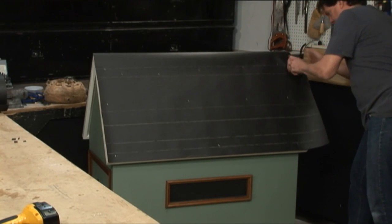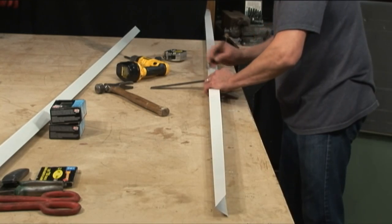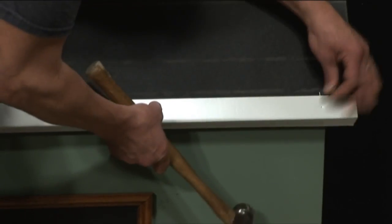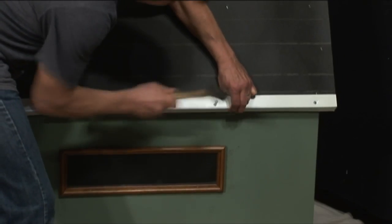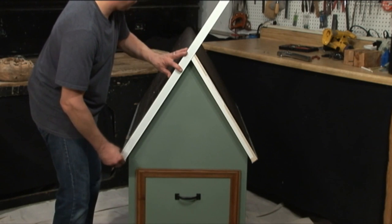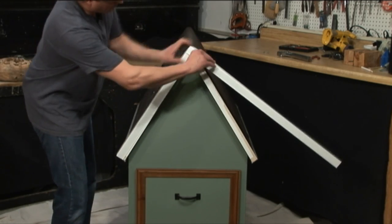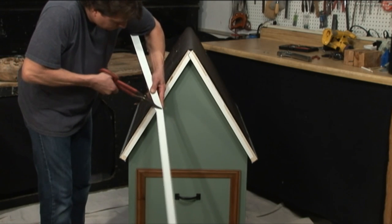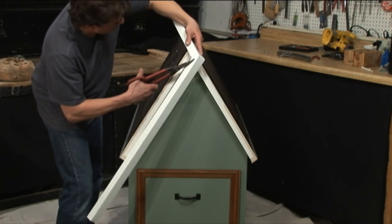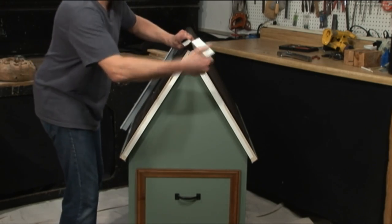Trim your tar paper using the side of the roof as your guide. When we measure for our drip edge, we come up with 45½ inches — make a mark on the drip edge and give it a nice square cut. If the cut doesn't go all the way through, wiggle it back and forth and it'll break. Flush your drip edge to the end and use your ⅝-inch nails to nail it in — a nail on each end and a couple in the middle. For the gable end, line up your drip edge to the piece you just installed, get your mark on where the top of the roof is, mark it, cut the side facing the camera, put it on, see how it looks, and cut a little more of the angle so it falls into place. Fold the drip edge into place and make a mark at the top and bottom where the metal meets, giving you a vertical line to cut to. Put it in place, mark the bottom, cut that off, and nail it in.